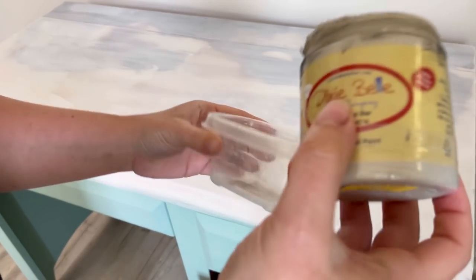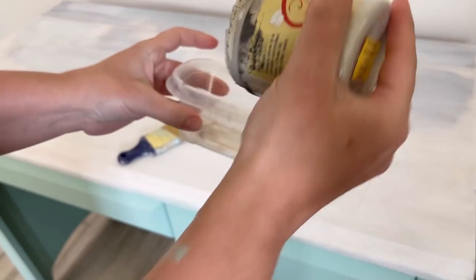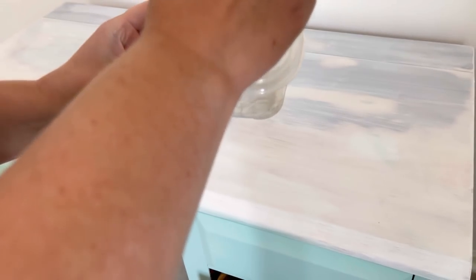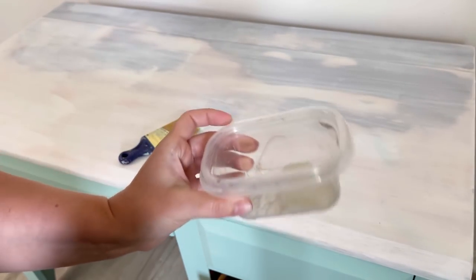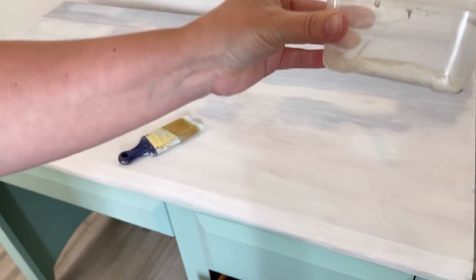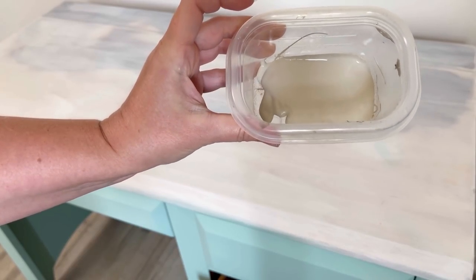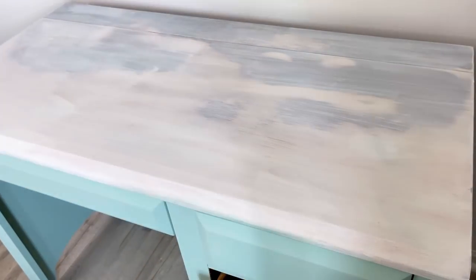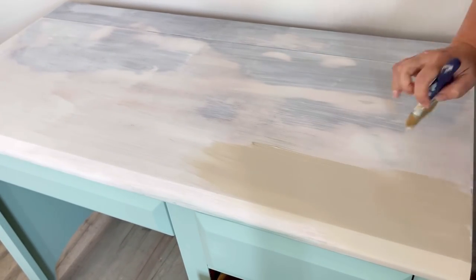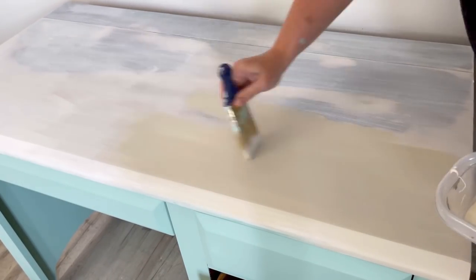Now the bottom is painted again — I did a second coat, and I want to go up to the top. So I'm going to use one ounce of Sandbar. These little containers I have measure, so it says where four ounces is, and this is about one ounce. I'm going to start and see what I can get done in one ounce. I'm using my water mister because not only does it help reduce brush strokes, but it also helps you get a lot more out of your paint. You still get great coverage — you just don't have to use as much paint.